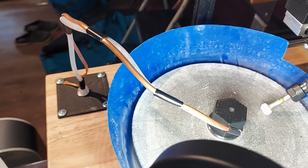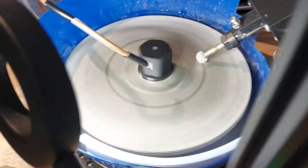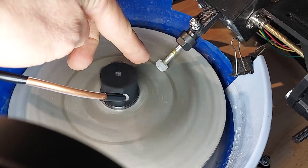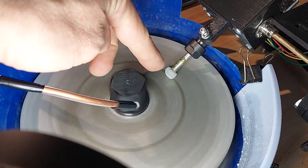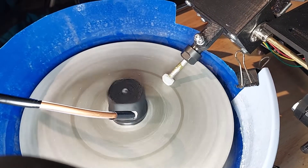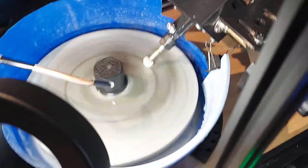It takes a little while to get going after the tubes run dry. I've got the drip going. You can hear it's just barely touching the wheel. What it's going to do is rotate the stone around twice, then rotate around twice again, then drop the stone down 0.025 millimeters. It's going to do that 10 times for a total drop of a quarter of a millimeter — that's almost half a millimeter it'll take off the diameter of the stone. And if I want to do it again, I can just repeat the program.